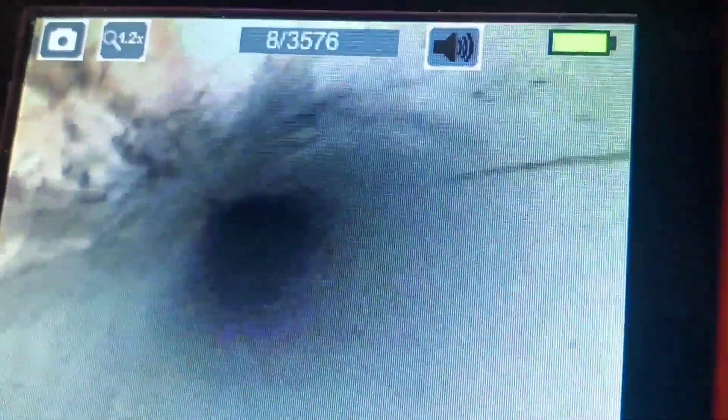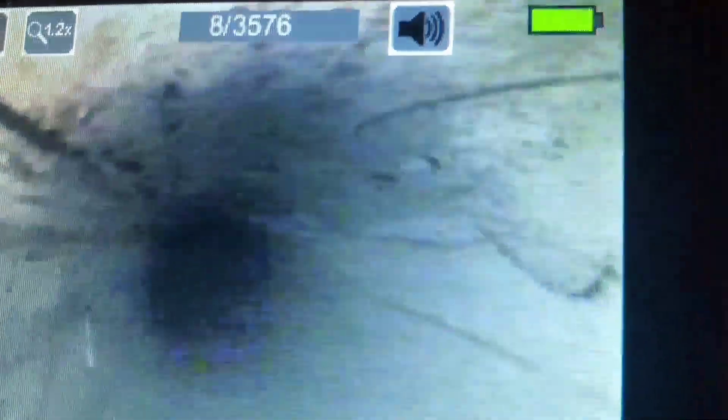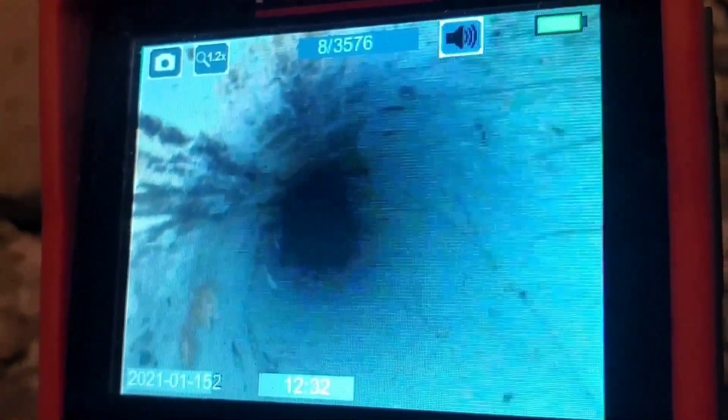You can have this going on unknowingly — and trust me, because I tear them out all the time. That's why I took the time to run a camera and show you what we find and see all the time. Look at all the points of failure. I will use PVC as a raceway — take a six-inch and use it as a sleeve, then put my four-inch through it if I know there are semi-trucks driving over it. I really like Hoffman Tile Company six-inch virgin yellow for driveway applications. But look at this — this pipe is in really bad shape.